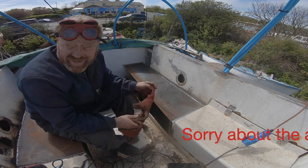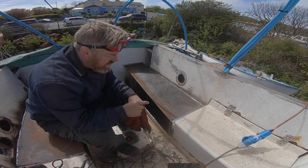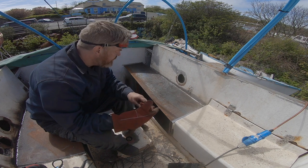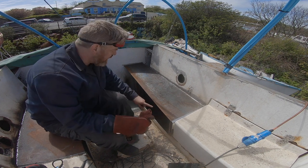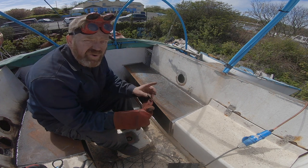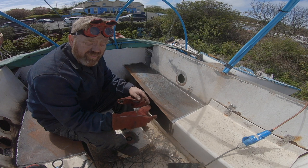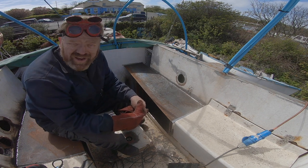Place. I'm just going to tack it with the stick welder today because I'm out of gas. I want to MIG weld the whole way around, but I'm just going to put some tacks to hold it in place so that if somebody stands on it, it doesn't move, and I'll MIG weld it properly when I've got more gas. If I've got time today, I'd like to do these front panels, but I don't think I'm going to have time. When I've done this, I'll check what time it is, give Melissa a ring, and see if I can stay out to play a bit longer.